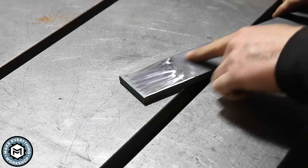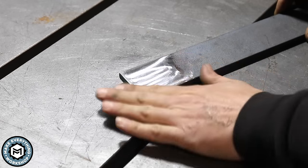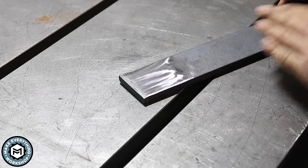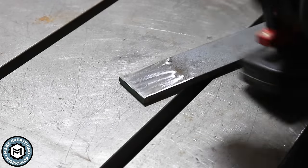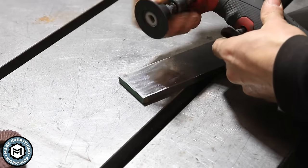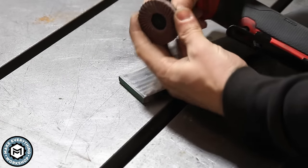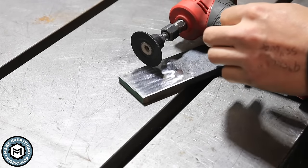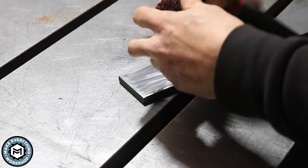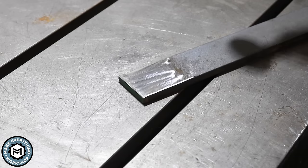It's very important to grind past the mill scale. If this was a welded piece, you may already have ground past it. But once we get past the flap disc, what's nice about these attachments is you're not changing out the actual arbor — you just twist out the grinding disc itself really fast. We're going to move up from that to this red surface conditioning pad, which all comes in this little kit.